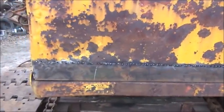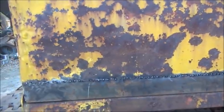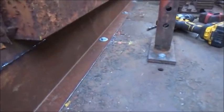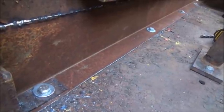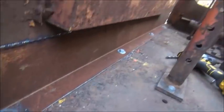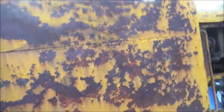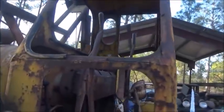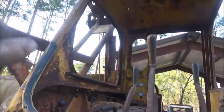I've been moving along without you — I sort of misplaced my camera, then my safety glasses. We got a lot of it spotted in and bolted in. I didn't do a plate; I just used bolts. The reason I didn't do a plate across the top like they had done is because there was a lot of rust in there — the water got between the plate. I know it's gonna get between the floor and this board, but adding another plate would just be another place for it. We're gonna leave it like it is and try to dry this thing in before too long — maybe get some windows in it so it doesn't leak too bad. The window on this side was a roll-up; the front top would have had a permanent windshield from a certain point up, and then another one that would slide up and over.